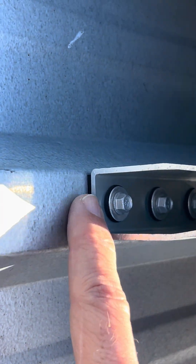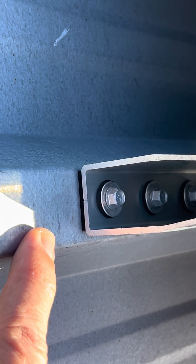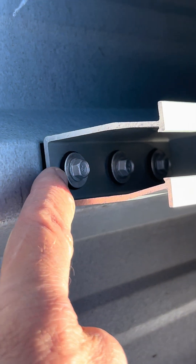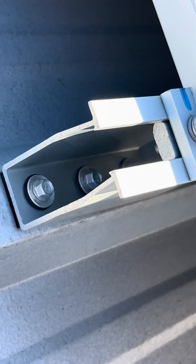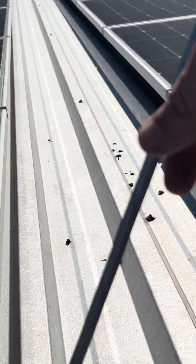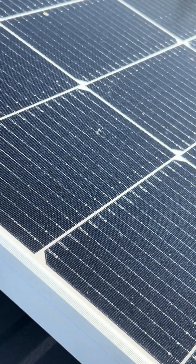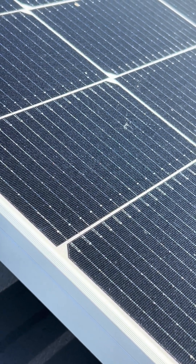The bracket is isolated from the roof itself with a black rubber insulator, and the screws themselves are insulated. So I don't know what these panels are actually connected to. If lightning were to strike this air termination rod, the question is where would the surge go? Let's see if we can find the bonding conductors.